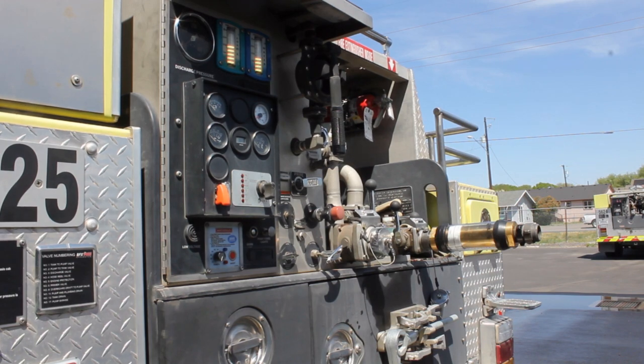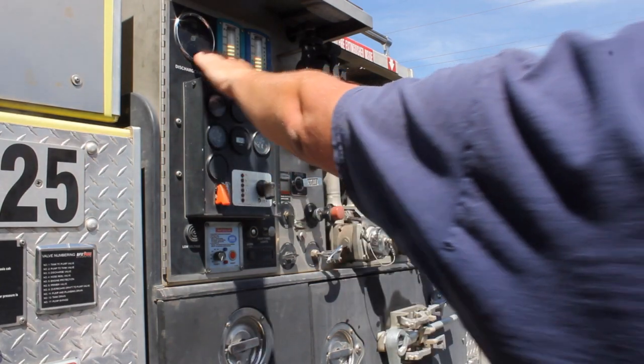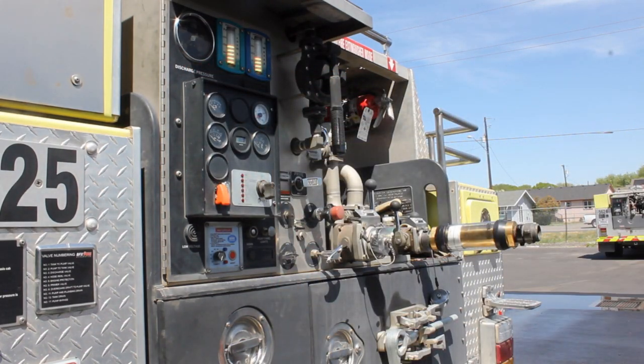But open your valve, bring it down to about 350, and then see if you can crank it up a little bit and get any better flow, or crank it down a little bit and get better flow. And that's the trick. When you crank it up and down, it also changes your pressure, so you have to kind of adjust. That's why you're doing the two-hand thing. But mostly after the second or third measurement, you're pretty close to the sweet spot, and it's a minimal amount. So you open it a little bit more to drop your pressure because you're flowing more water. When you drop it down to 200 or 250 or whatever you're looking at, you just have to back it off a little bit and see if your flow comes up. Crank it up a little bit and see if your flow comes up. Does it adjust what's on here? A little bit. If you noticed, not that much, because we're moving pretty high volumes.